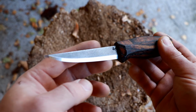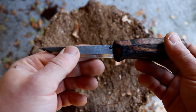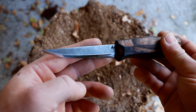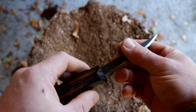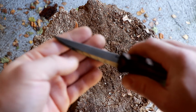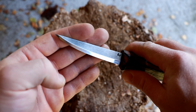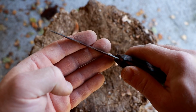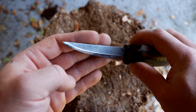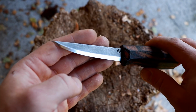At the same time, the steel really lends itself to experimenting with it a little bit. It really gets a very fine grain. You can get incredibly hard and tough blades. It's just an overall awesome steel. In this day and age where everybody is a little bit of a steel snob and everything has to be some super steel with some fancy name, these basic carbon steels are getting out of people's attention a little bit, but they definitely deserve more attention. That's why I'm using 01 and 1084 a lot in my own blades as well.